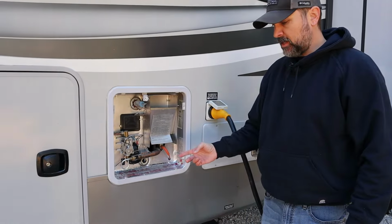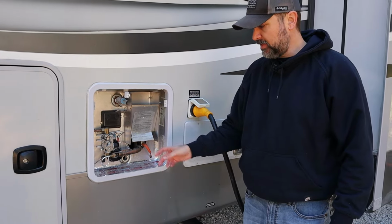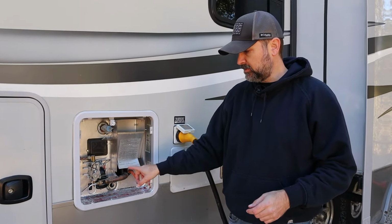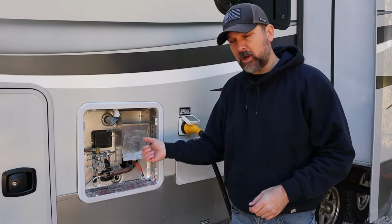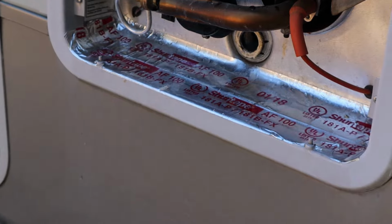So while I have this open, I'm actually going to stick a hose in there and try to flush some of the gunk out of there. They do make little tools, and I'll leave a link below. I don't have one right now, but it's basically a probe that goes in there and flushes the water heater out. And I'm also going to turn on the water again, give it some pressure, and try to push some of that gunk out. Coming at you.